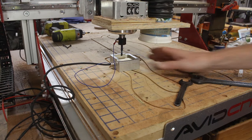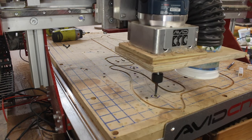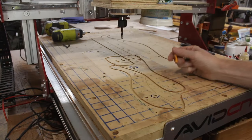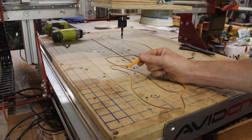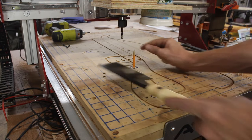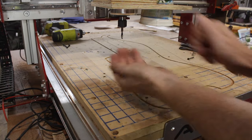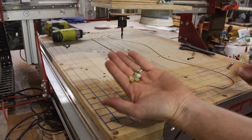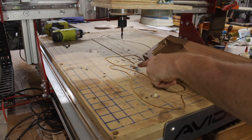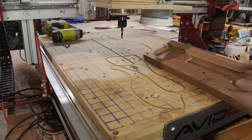For the guides I reset my zero to be right at the waste board level and just drill in about three-tenths of an inch — a couple of holes for position markers. I tend to use old short pencils and stick them in the hole. I make a 0.3-inch hole, cut a little bit off the pencil, and save them so I don't waste pencil. Since they're not perfectly measured they can only go in one way, so you can't accidentally put them in wrong.